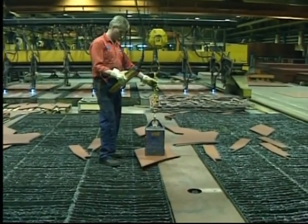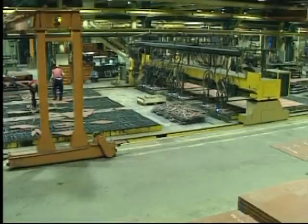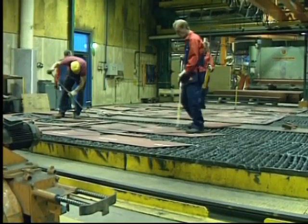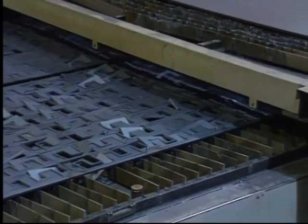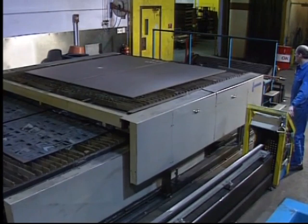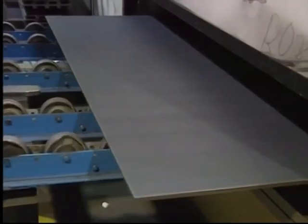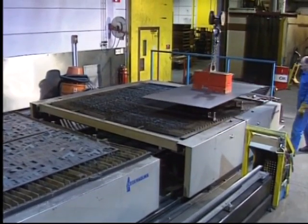In addition to steps taken to increase cutting speed, it's important to minimize all operating expenses. This machine has the cutting table at floor level, making loading and unloading fast and easy. There's no downtime due to material loading. Stops in production are also avoided with systems employing double movable tables. One advantage with this system is that it requires less workspace. But this also means that metal handling has to be well organized. A thought-through metal handling system can optimize the profitability of a cutting department.